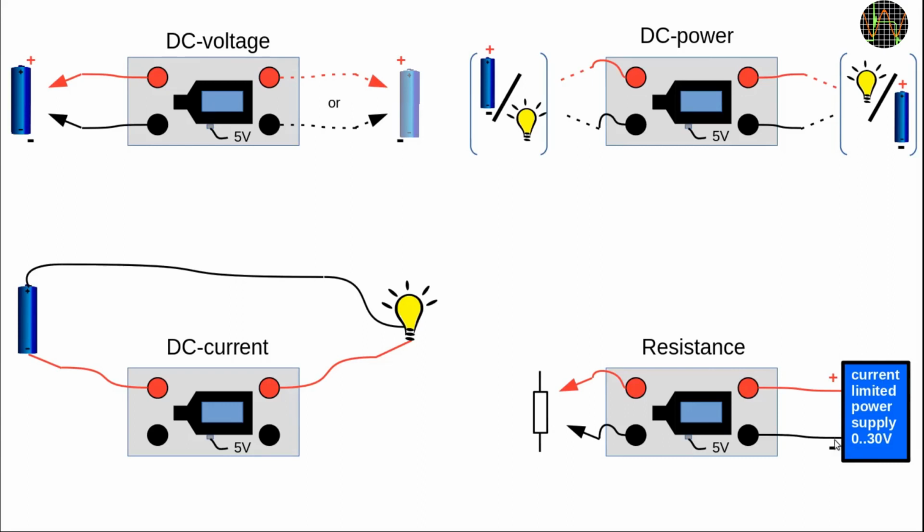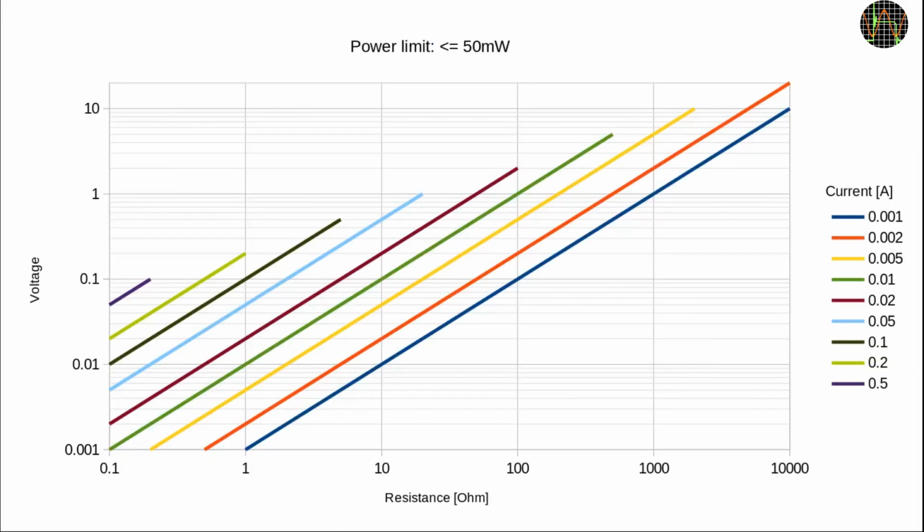The reason behind this is that on one hand you want sufficient voltage and current to get as high as possible numbers on both measurements to be able to calculate a meaningful result. But in doing this, it becomes very easy to overload the resistor and release its magic smoke. In fact, you need to stay well below that to avoid stressing the resistor and causing it to change its specifications. To help, I made this chart which plots all allowed voltages and resistance and current combinations that will load the resistor with 50 milliwatts or less. That should not cause any damage even when measuring a tiny 1/8 of a watt resistor. I'll make this chart available for download in my GitHub page, link in the description.